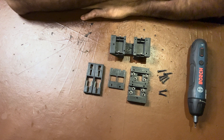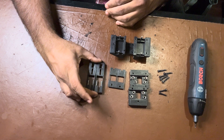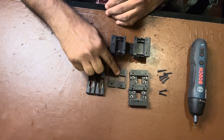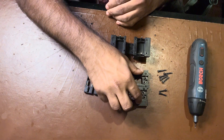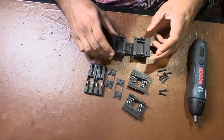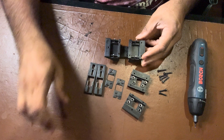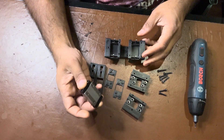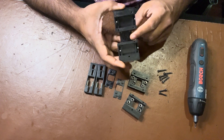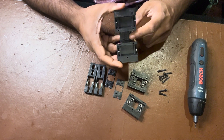The BOM is also up on the GitHub page. There are six pieces in total that need to be printed: two sliding lock mechanisms, two spring compressions, two lock bodies — this is the bottom one and this is the top one — and then one integrated carriage that sits on an MGN12H block like this.